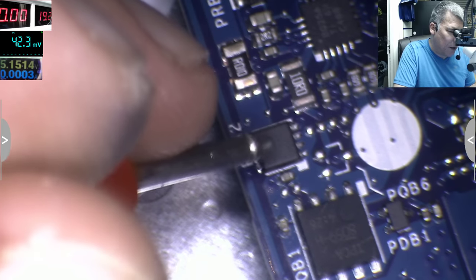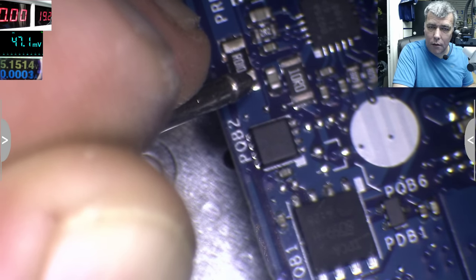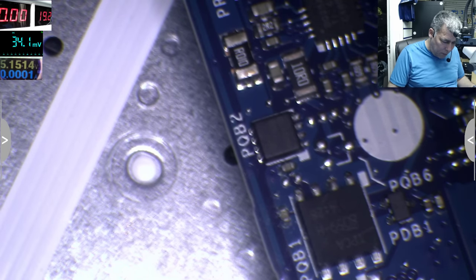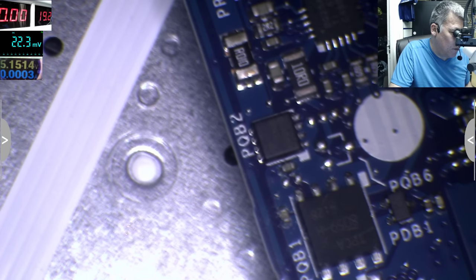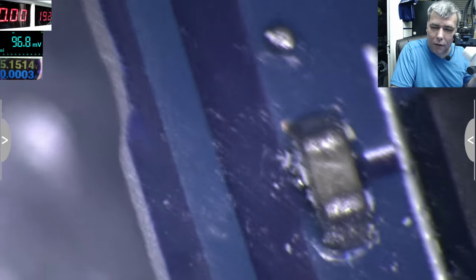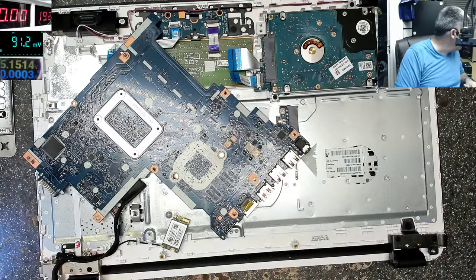After the second MOSFET, we have another switch here, yeah? After this one, it's not short. So check that on the power supply, it's not short. Even on our main 19 volts power end, it's not short. So it's safe to say that the MOSFET is dead, yes or no? Or it can be because of this water damage here. This looks like water damage. What do you think? Looks like it. Let's clean it.